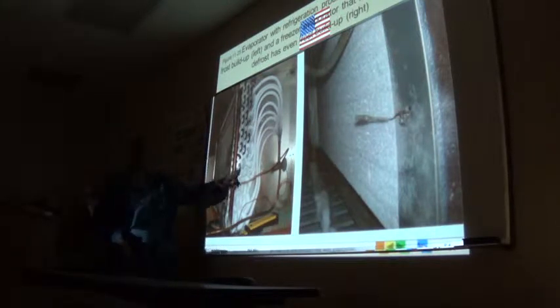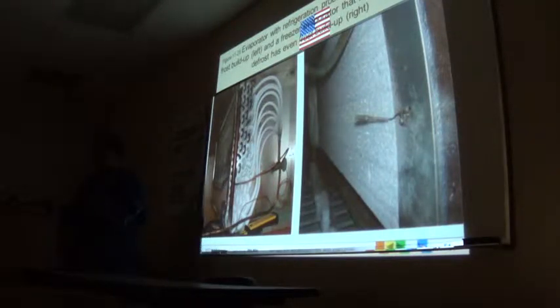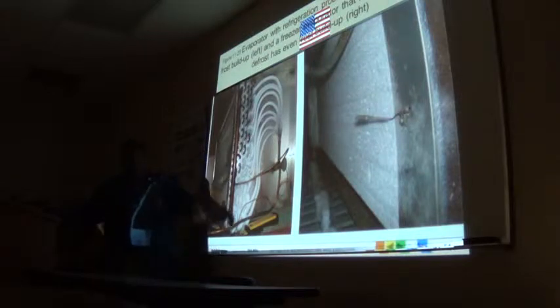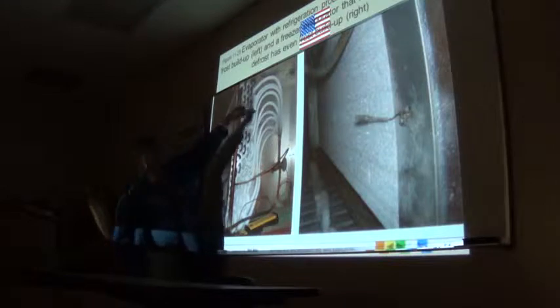This one in here, definitely, we do have a problem, but I would take the ice out, start it up, and see what kind of pattern I'm getting here, right? In this case, if everything here is getting a frost line except for here, it has to be something just downstream of this distributor tube, in that capillary tube. And what if it goes into the evaporator coils? Yeah, you see where it goes in? The problem is probably right at that point.